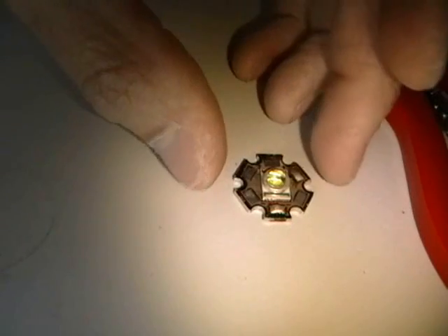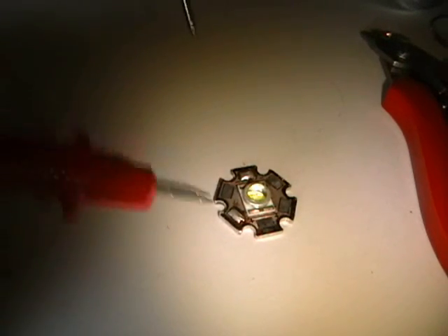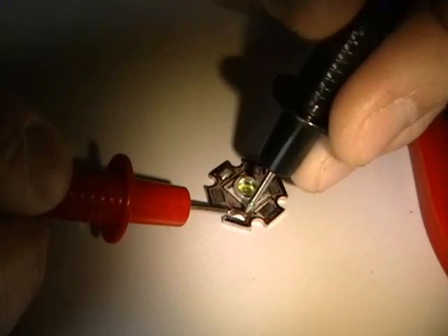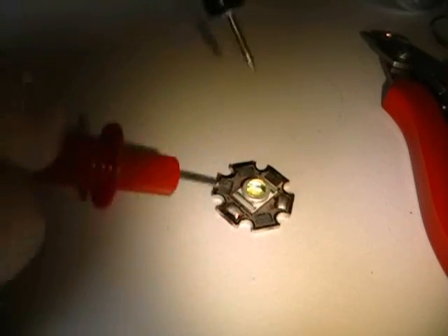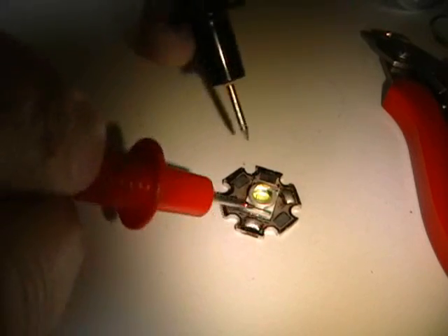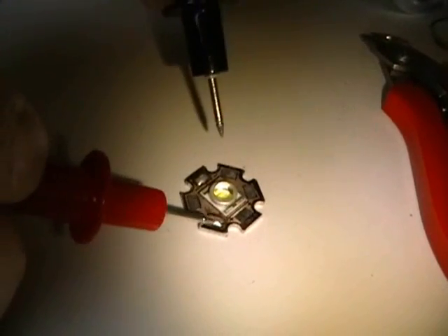So let's hope electrically I've made my soldered points correctly. What you want to do now is check for continuity between the solder pads for your wires and the electrical conduction points on the LED. I have conduction through the solder traces from the solder pad into the positive terminal on the LED on one side. Now I'm turning it around to check for continuity between the negative solder pad and the negative LED conduction point. I've got it. If you somehow don't get solder to flow, you could also wire solder straight onto the terminal strips for the negative and positive sides — I've seen LEDs wired up that way. But for this application, I'm just using the two solder pads provided by the flashlight manufacturer.